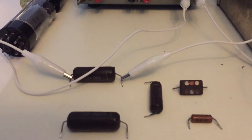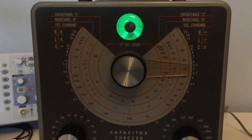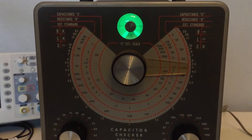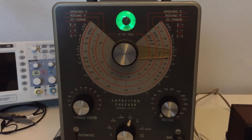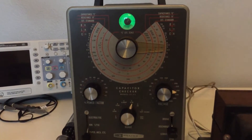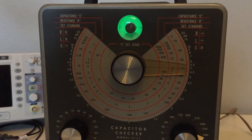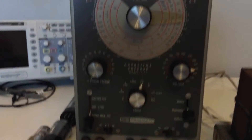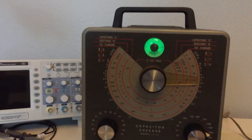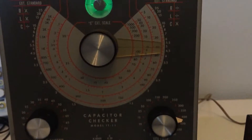The first capacitor on the test reads 0.1 on my meter. This meter has just been redone — I have another video and will post it if you're interested to see how it was restored. So we know the measurement of capacitance is good with this capacitor. I have my tester set up to 400 volts and it's set for paper mica, which means the eye will start opening at about 2 microamps and will be completely open if there is no leakage. After hitting the leakage button, what we saw was the charge of the capacitor and then no leakage after it had charged. This capacitor is good.